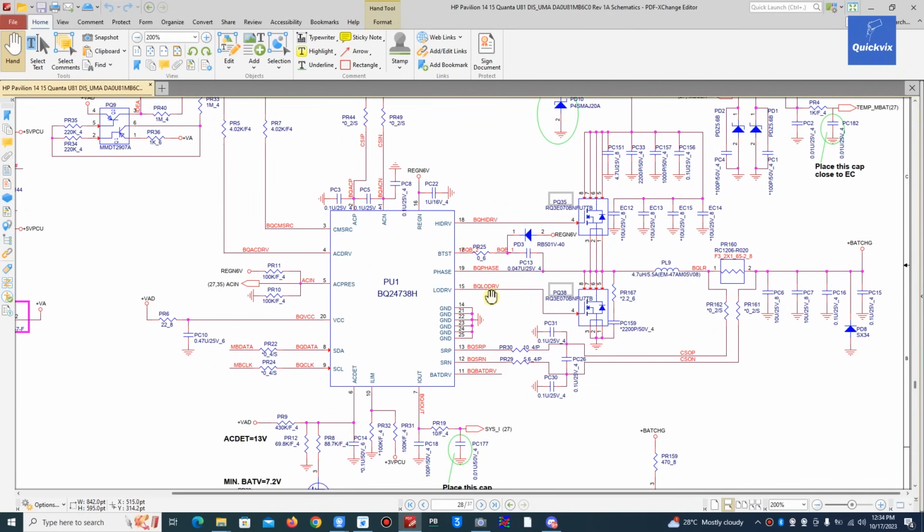let's come here. We have 15 volts here. We have 15 volts on pin 17 as well. Of course, we can have 15 on pin 17 because this is battery voltage here, and it's coming. Nothing can stop it. It's coming back straight to this phase, and you can see this is only a capacitor, and nothing can stop it. Yes, we can have it.